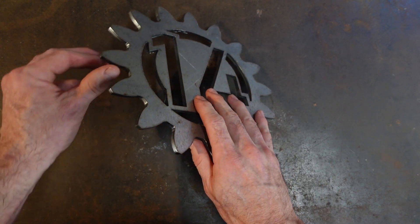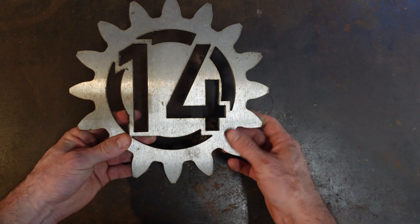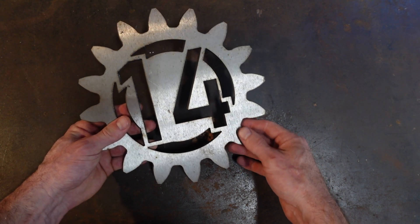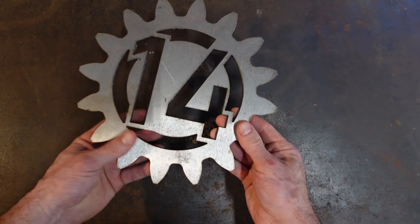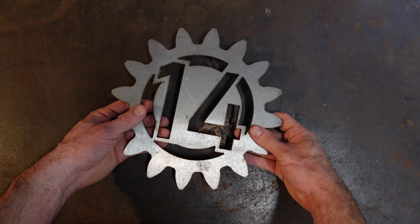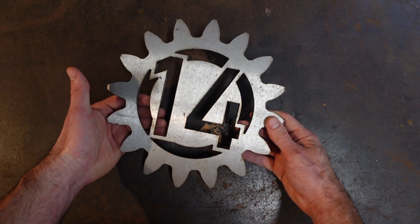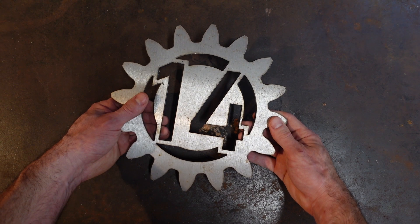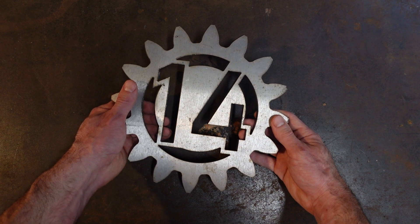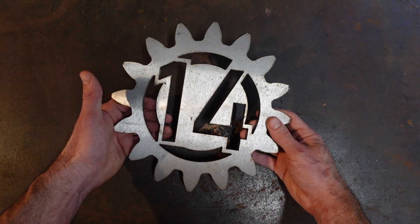It does have a little bit of an angle beneath the top, but I think that was mostly caused by the tip we were using on our plasma cutter — it had already been through some abuse and it was probably time to change it out. This is the first time I've generated g-code for a plasma cutter so I've still got some learning to do in that regard. I think we've definitively answered the question of whether you can turn your Shapeoko into a plasma cutter. But the more important question is probably: does it make sense to do so? And the answer for most people is probably no — unless you just happen to have one lying around, it just makes more sense to buy components more specialized for plasma cutting. But we had fun doing it, and I think we're going to get some pretty good cuts out of it, at least until a piece of molten metal destroys our belts.